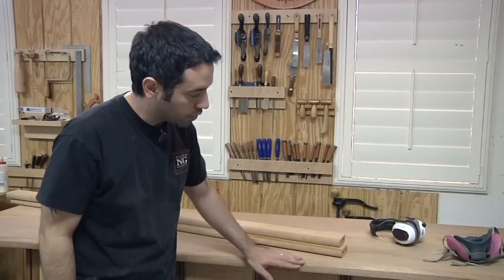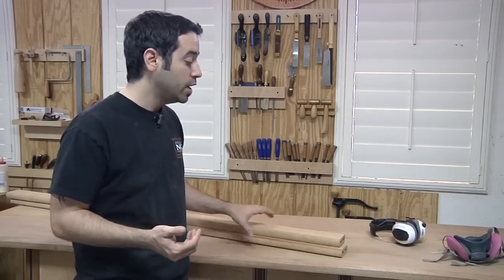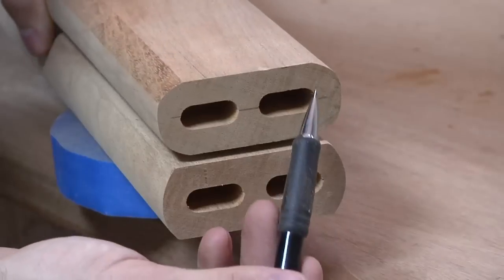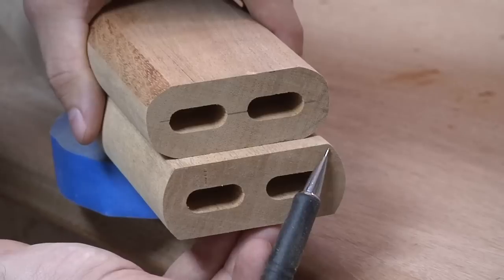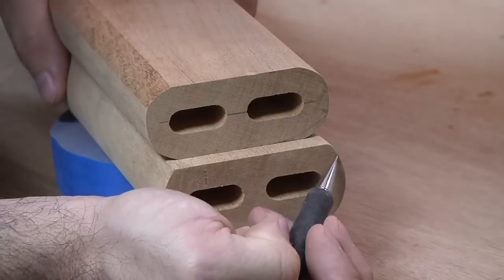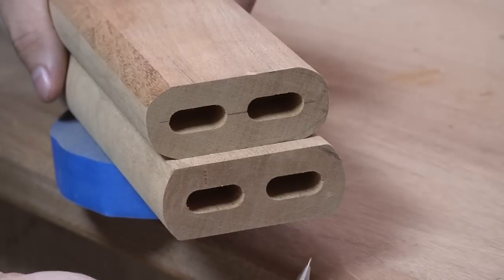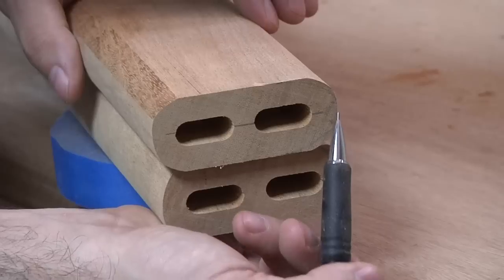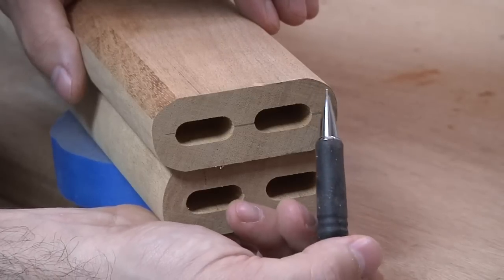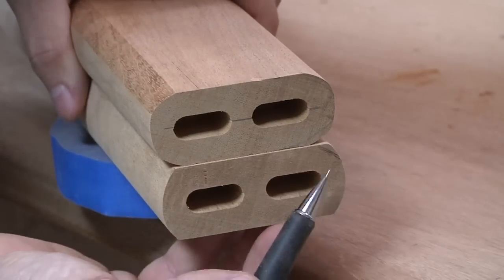I took a close look at the roundover we created here and I really like what it does to the surface. It got me thinking: is there anywhere else that I've already done a roundover that I might be able to use that bit to improve on? Let me show you what I did with the cross members. You can see the top piece has had the additional routing done that created this extra edge, and the bottom is the old version. Essentially what I'm doing is removing some of this material to help soften that curve a little bit more. It's going to need a little bit of sanding to further smooth this, but you can see it just makes a nicer, more flowing curve that matches the look of the piece compared to the original standard roundover.